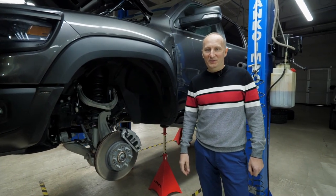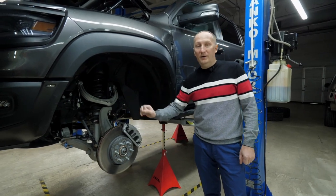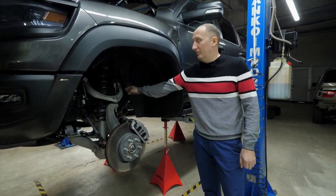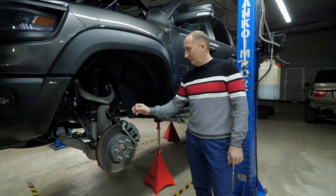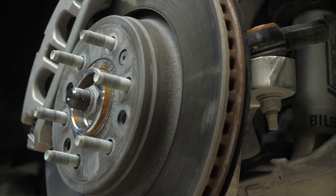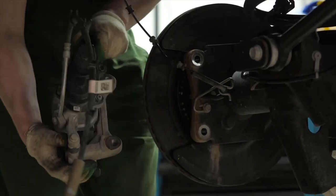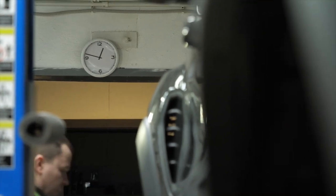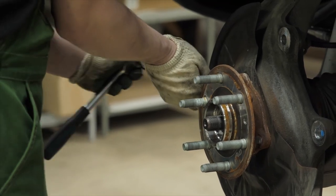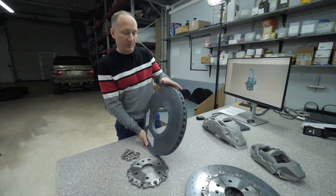As a certified engineer, we will apply a modern design method, scanning the components of the brake system — the knuckle and the wheel disc. For the front axle, the new brake rotor will be 400 mm in diameter and 40 mm thick. It is very light — we will do a comparative analysis afterwards. And a wonderful 10-piston caliper by the Akebono company.